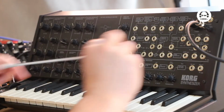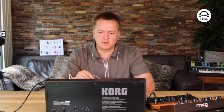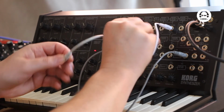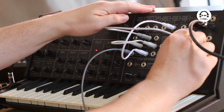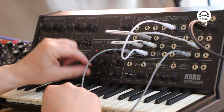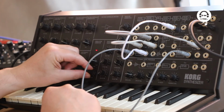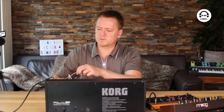Let's get some white noise as the input for the random sound. Put that into the sample and hold. We want it to sample a noise every time we hit a key. So let's take the envelope generator out. Every time I press something, we're getting a different tone. And let's automate that so it's always playing. So we'll take the clock out and we'll put that into the trigger in. So there we go, we've got a constantly triggering note. Let's plug it back in again.